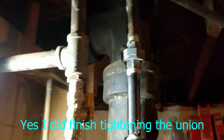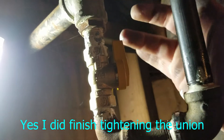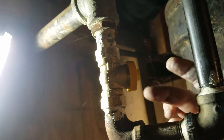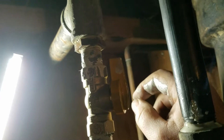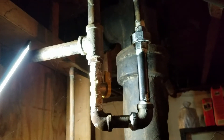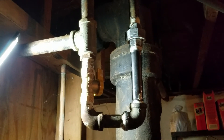So now we're just going to put that all back together. When you get the gas turned on — if the valve is going up and down with the pipe, that means the valve is open. When you want to shut it off, you run this across the pipe like that — so that is off, and that is on. That's how a ball valve works. I believe we are done. All I'm going to do is call the gas company and have them come out and leak test it, pressure test it, and we're good. See ya. Thank you.